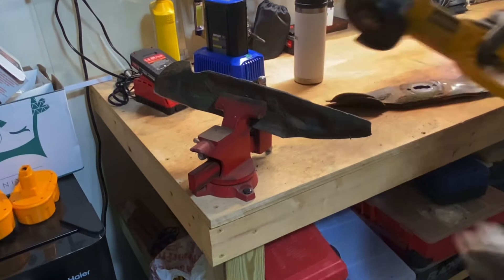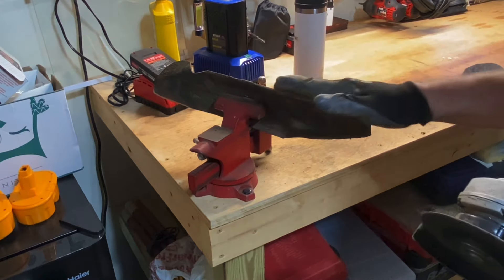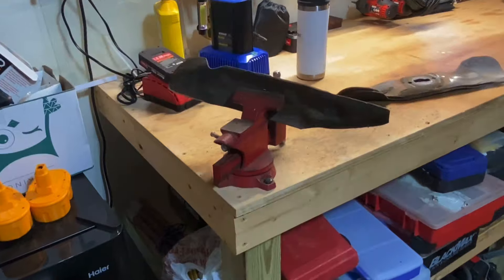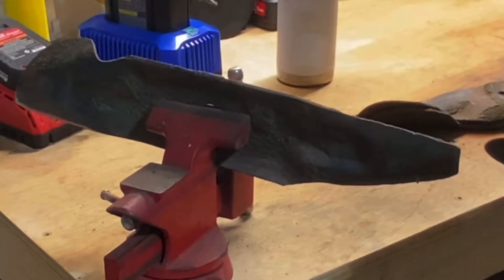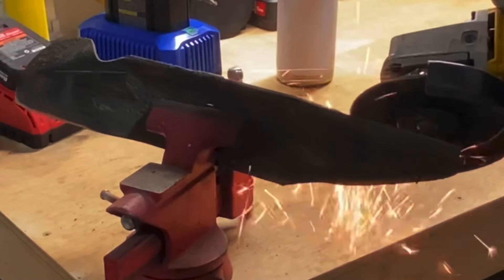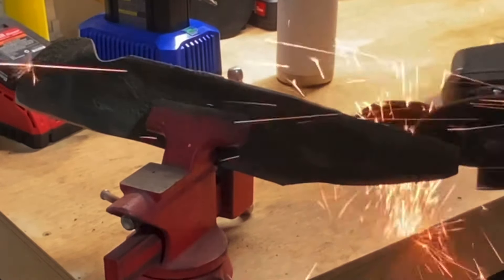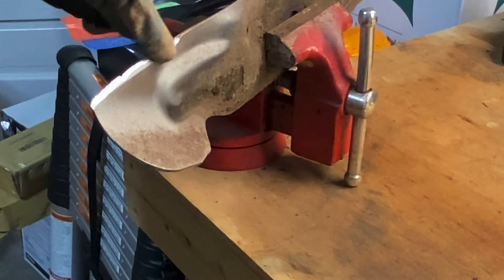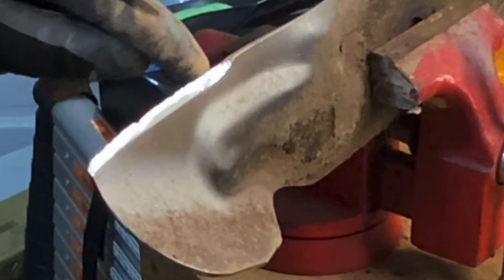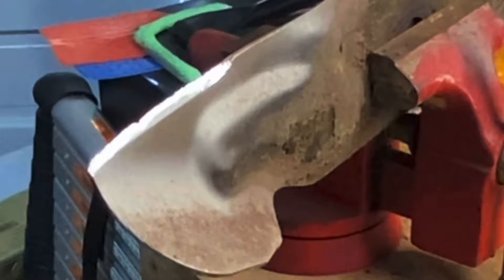This is the angle part — we're going to angle it back out and get it smooth. Then we're going to take the grinder along the back to make that blade. The sharper it is, the better it's going to cut. Just try to follow along the factory angle, take it down until you start seeing a blade at the top, and then come along the back and take off that rounded part.